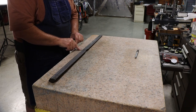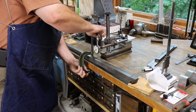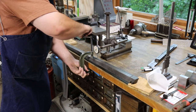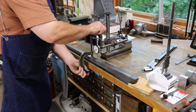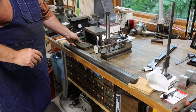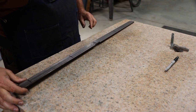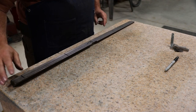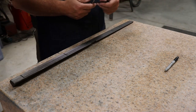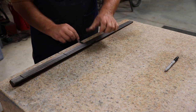It slides under there, but I can actually feel some tension on it, so we haven't got far to go. Let me zero that right there. Flex it down, come back off. And we've gone about 5 thou, so let's see what it looks like now. Alright, so it's still pivoting on the ends, but I can tell it's moved down just a little bit from where it was before. But we are probably close enough now that we're just going to have to start scraping. I can feel that tension in there with that 5 thou one.